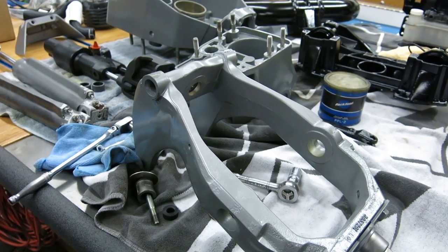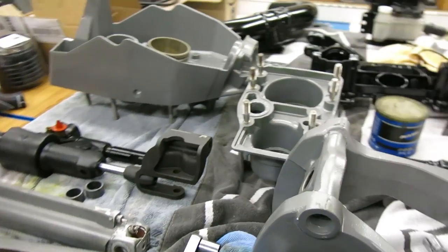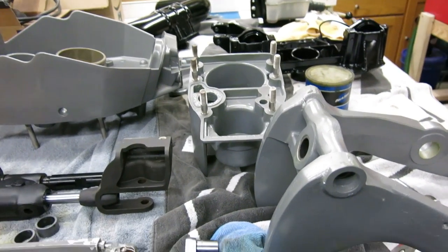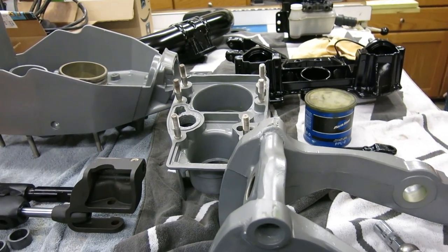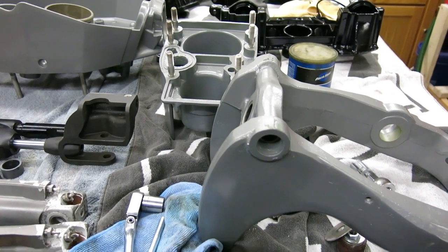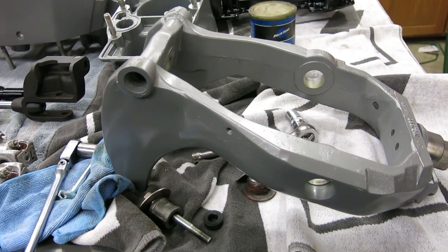So I have my 2004 Cobalt 250 and what I found as I was cleaning up this winter was that there was a whole lot more corrosion from the saltwater exposure of the previous owners than I kind of thought when we bought it. So in an effort to clean it all up, I tore everything down on the transom this winter and bead blasted it and now we've got some paint on it and we're going to put it all back together.